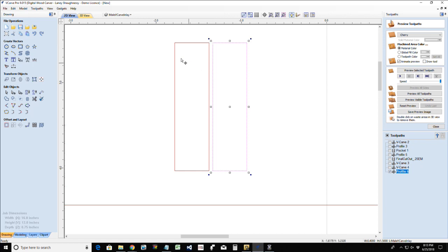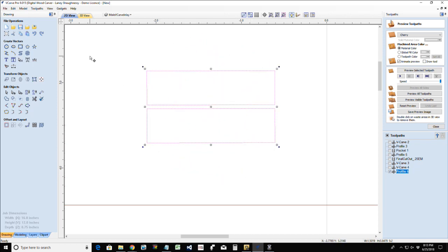Or if you didn't want to do that, then you could set them up on your CNC table, and you could have your CNC mill away the top surface until it's gone, and then do some finish sanding to finalize. You don't want to mill all the way to the top of your cutting board. You want to leave some room there, and you will finish sand that nice and flush, cleaning up all the edges and things, any glue squeeze out that might occur or anything like that.